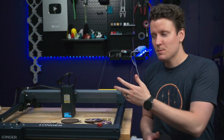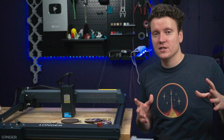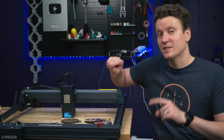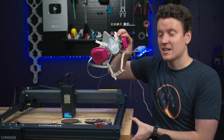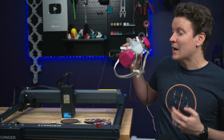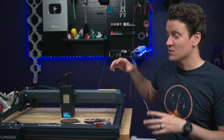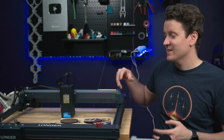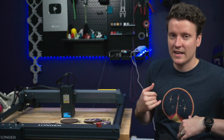If you're making money off your laser, spending a bit more to make something like this can make sense. I really wanted to start off with the safety side here, because these really aren't for everyone. This is a lot of power and can do a lot of damage very quickly. I've been using a full 3M mask the entire week whenever I was in the room where this was running or had been running, because my exhaust system worked well for 5 and 10 watt lasers, but this creates a lot more smoke and toxic bad fumes.